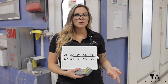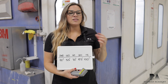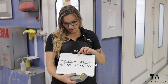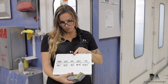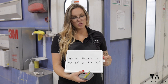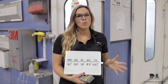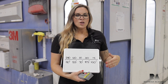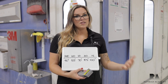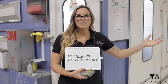The other thing to think through is the solvents and products that you're choosing — temperature should be a real consideration. If you're spraying a product with a 60-minute dry time at 70 degrees, but you're spraying that product in 100-degree weather, you're now dealing with a 15-minute dry time, which may not work with your overall process. You may want to choose different additives or solvents to slow down the product and give you enough time to work with it, particularly on a larger job. If you were spraying a bus, that could be a problem.